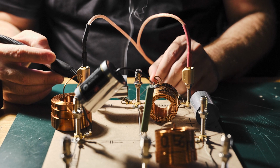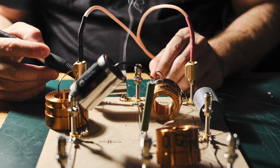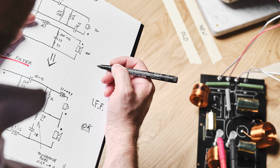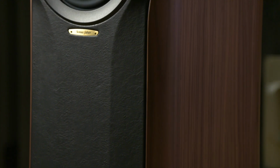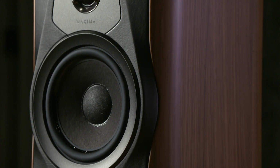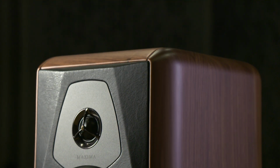The series crossover network has the particular characteristic of having the tweeter high pass, which has an influence and impact on the mid-woofer low pass, and vice versa. And so basically this solution potentially led to the perfect merge of the two-way drivers, enhancing even further the two-way concept, creating the best possible, the maximum interconnection between the job performed by the two drivers.